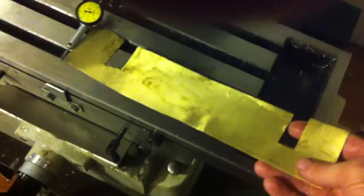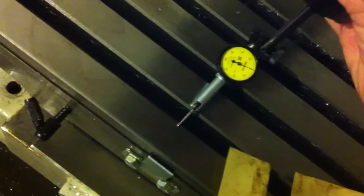So I made a shim like this, chucked it in at the bottom there, slid it under — quite hard to lift up — and yeah, that's fixed it. The runout now is zero the whole way around, or very near zero.